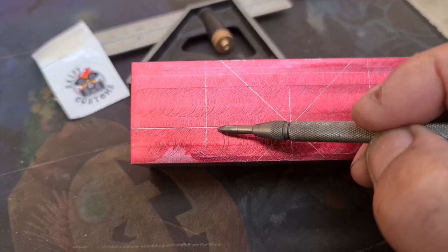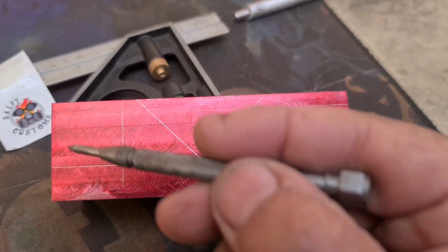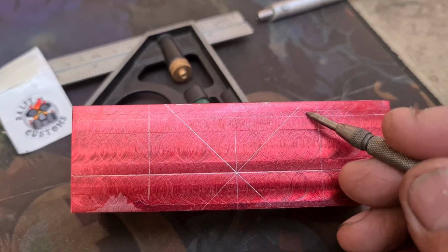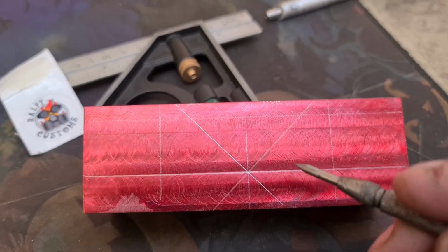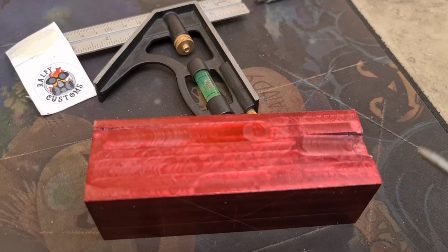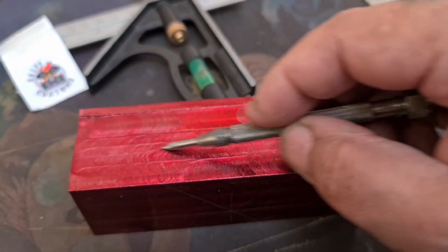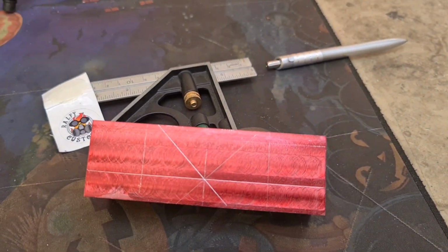I might bring them in, or I might leave them completely and not machine this part out, because I'm thinking of putting a V horizontally on this face of it. So what I'm going to do first, I'm going to machine this down, and I'm going to cut the V, because I know I want that, and this bit. And then we're going to look, maybe this face, well, it won't be this face, it'll be the new face. I'll come just above the mounting holes that'll be there, and make another V. Maybe, we'll see. But there you go, that's next on the agenda.